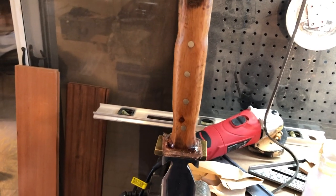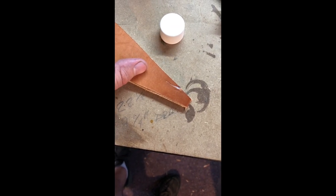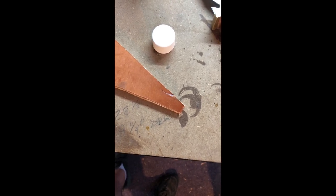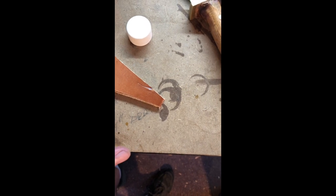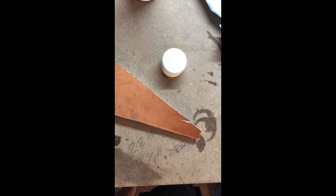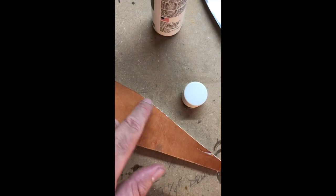I'm going to attempt to etch the blade. First I'm just gluing a couple pieces of leather together and then I'm going to stitch it. What I like to do is use a drill press — first I mark out where the holes go on the edge after I clean up the edges with a belt sander to make it look nice and uniform. Then I mark my edges across so they're even, and that gives me a place to mark where I'm going to drill the stitch holes. I've got a leather wheel that marks off stitch points — you just roll it inside the groove.